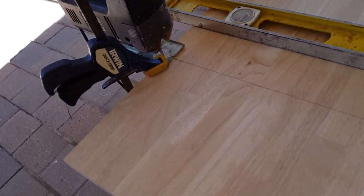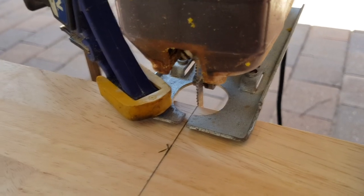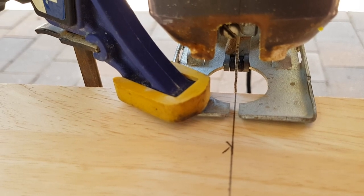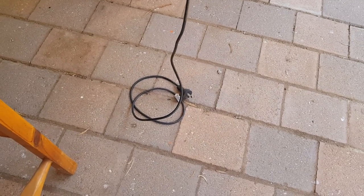Right now I'm at the point where I'm about to make the cut on the bench top. It's an interesting way that I'm setting it up due to the tools I have available, and I thought I'd film it so you can see. I've got my jigsaw set up with the blade on the line — I want to cut on the line as straight as possible. It's clamped to the bench top so it's suspended in mid-air, plug unplugged, and I'm about to set it up to cut straight. See how I do this with my jigsaw and two or three clamps and a straight edge.